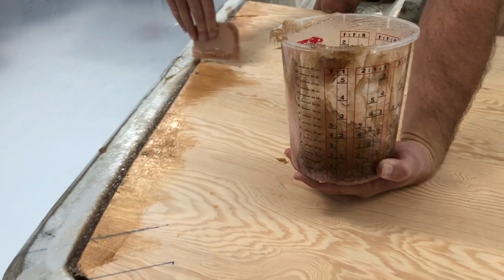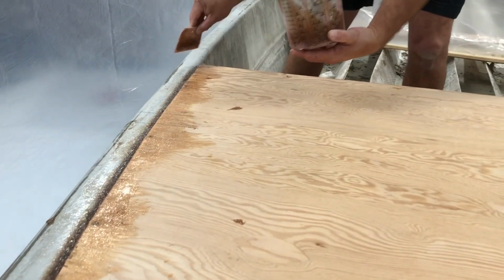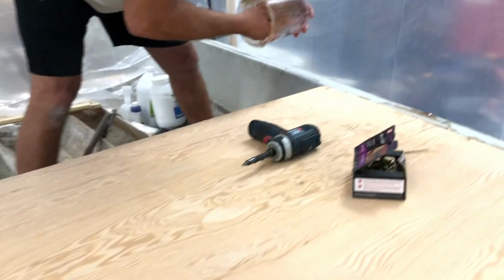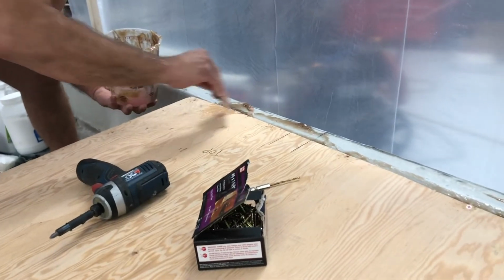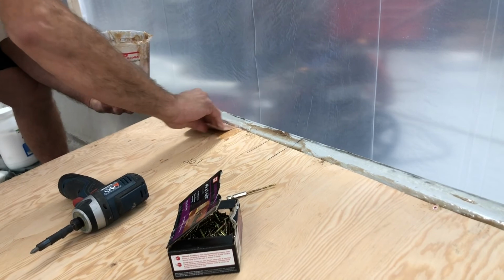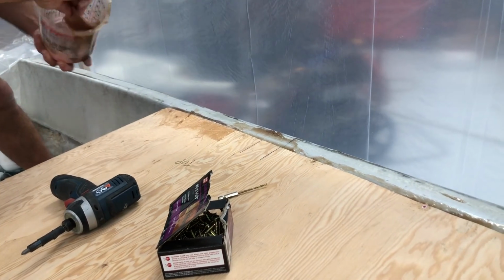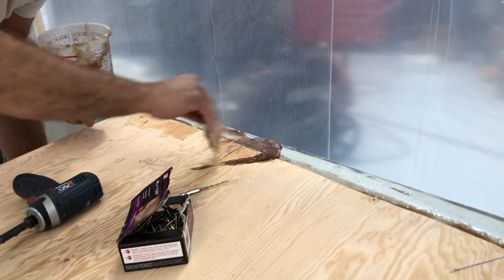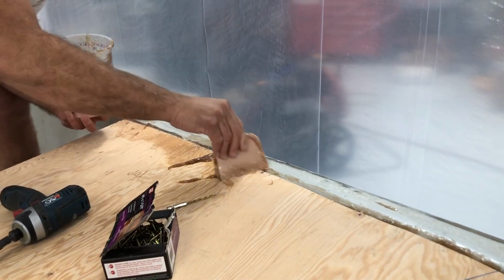Thanks for watching. Here you can see the leftover fiberglass peanut butter I have. I'm just going back and filling in the gaps between the top of the casting deck and the side gunnel edge of the boat. This will allow for the deck to be tied into the side of the boat nice and tight. I'll come back and laminate the top with 2 layers of chopped woven, and that'll be in a different video.